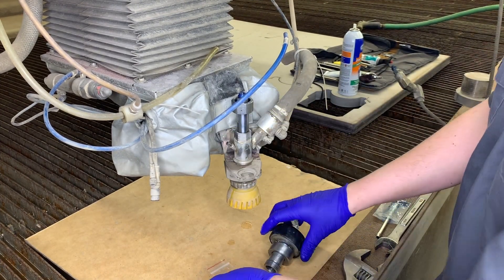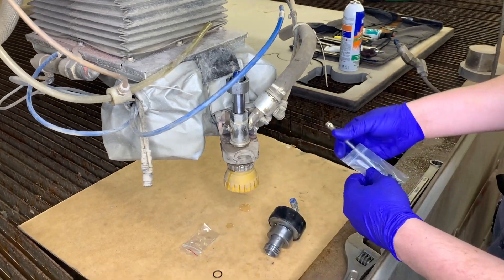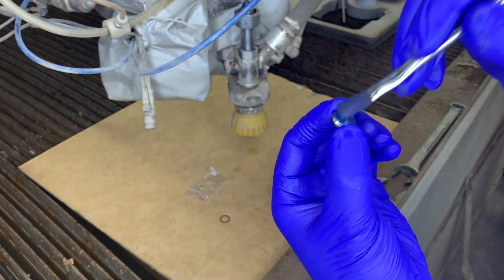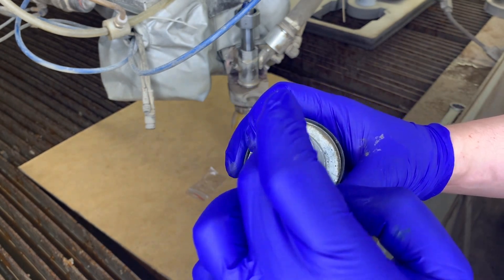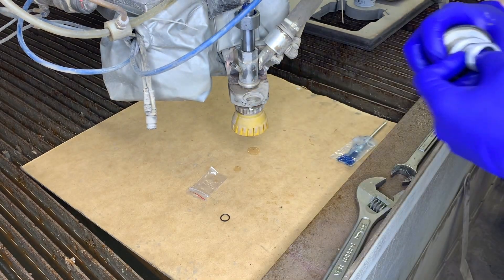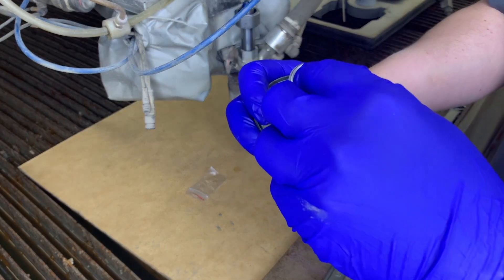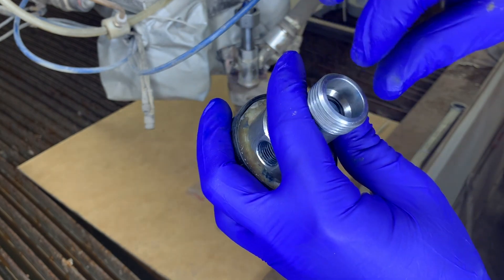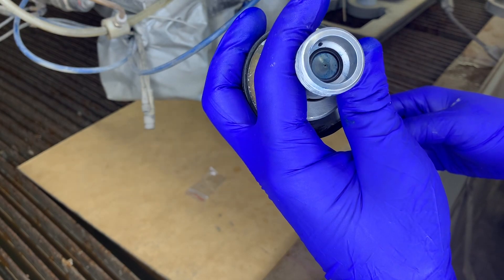Back at the table, grab your air actuator assembly with the valve body. Take out your on/off valve seat and apply some blue goop to that seat. Once you've got a good coating of blue goop on each side of the seat, place the seat inside the bottom side of the valve body. Then take your black o-ring and place that alongside the seat, using the o-ring to hold the seat in place so that as you tip up the air actuator the seat doesn't fall out the bottom into the tank.